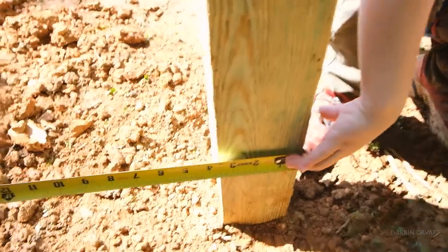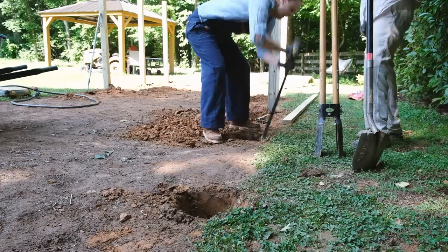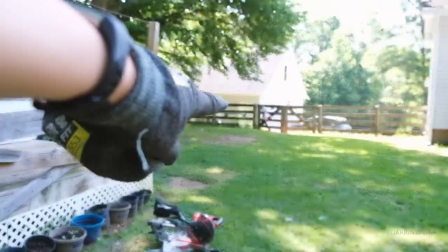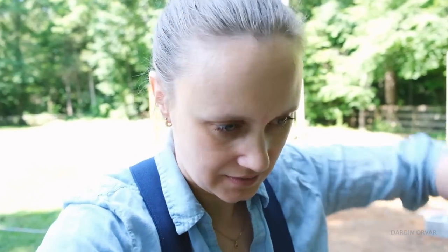This is the corner post at the end. The whole structure is going to be 24 feet. That's the very last hole. Once all these holes have been dug, it's not the end of the digging — we also need to dig a trench from here to the shop about two feet deep, and in it we're going to have a big pipe with a lot of wires. There are roots and stuff so that's a lot more digging. They're also going to put in a grounding rod in the corner, eight feet down, to direct lightning into the ground.